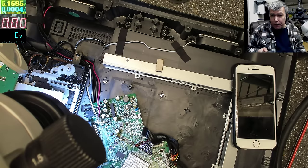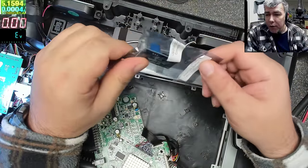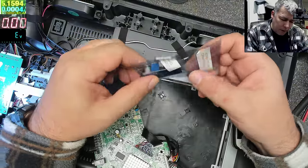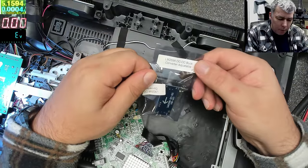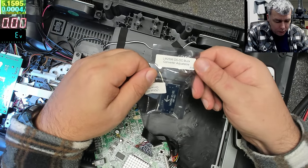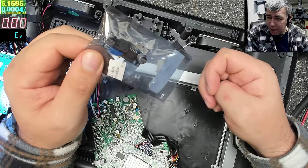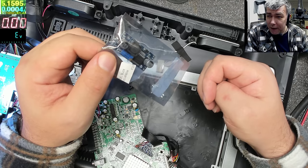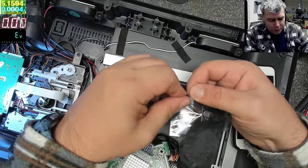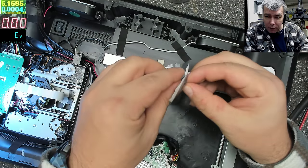I really recommend this to anyone who wants to modify things. This is cheap, around 2.5 or 3 pounds on eBay. Yes, proper cheap. This circuit is based on the LM2596, a DC to DC buck converter, adjustable. It's a switching power supply that can supply any voltage, and I think around 2 to 3 amps. It's proper nice. I haven't opened this one, I will open it now. But you can use it and modify anything.